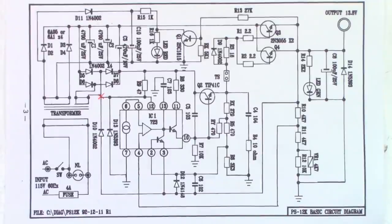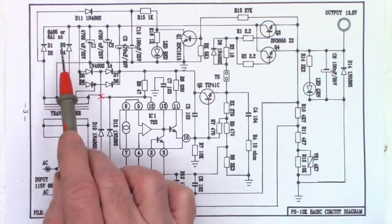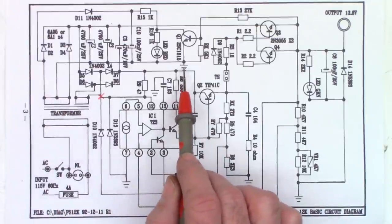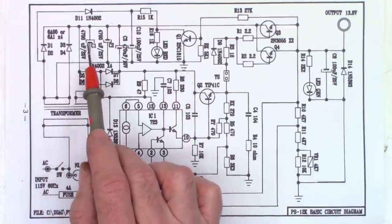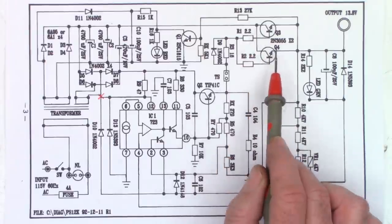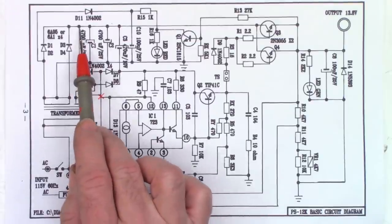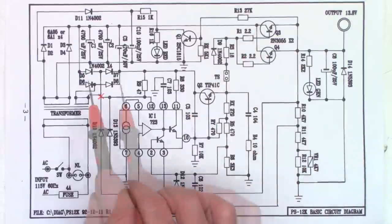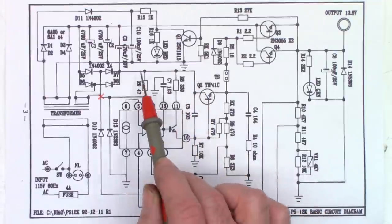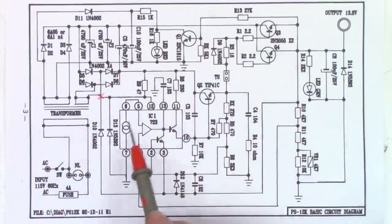So this is the schematic for this unit. Pretty simple. It looks like they're using two diodes in parallel, so they're still using a full wave bridge rectifier because they say D1, D2, D3, D4, and this center tap lead actually becomes ground. They rectify that and filter it through two 4700 microfarad 25 volt caps, and that becomes the collector source voltage for the two 2N3055 transistors. Then they have this full wave bridge rectifier set up with the negative going to the positive of the pass transistors, and the positive being filtered through a 470 at 10 volt capacitor, and that's the drive for the LM723. So they have actually separate power supplies for the outputs and for the regulator transistors.